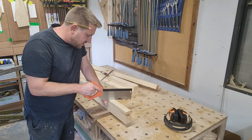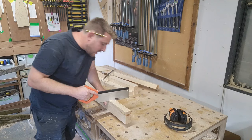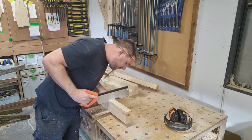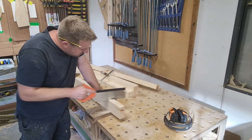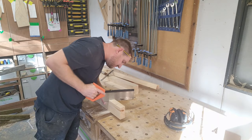And although this isn't a piece of furniture, come down, you see where you're going. We want it to be quite a tight joint. Because although it's held good with screws, ideally the friction of the two bits of wood is what we really want to hold it together. Then the other side. Just start on the front or the back. Cuts level across, you know you've got it.